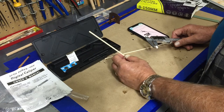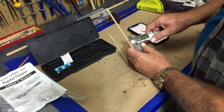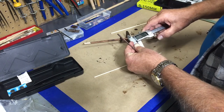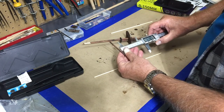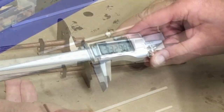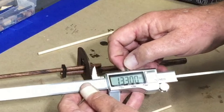The smaller one I think should turn out to be 0.03. I'll zero it out — it's already zeroed. As an example, here's a mast I'm working on. It was supposed to be 133 millimeters in length. So I take this up to 133 — I'm getting close — and now I'll use that wheel to dial it in precisely.